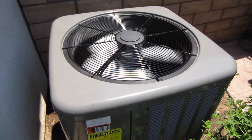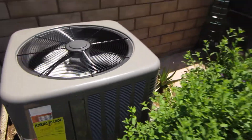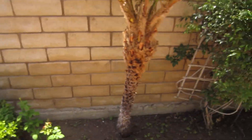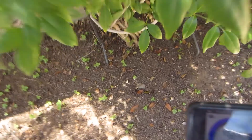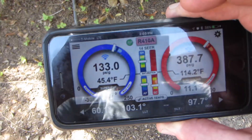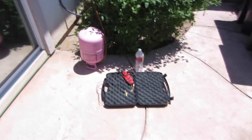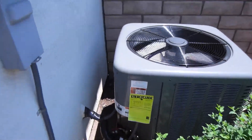Got her up and running. We're under a heavy load — it's 97 degrees out right now. 97.7°, 60-degree suction line. We're under a heavy load and it's cooling down good.